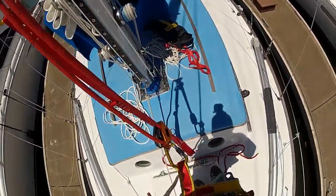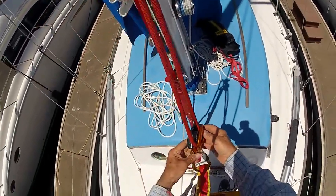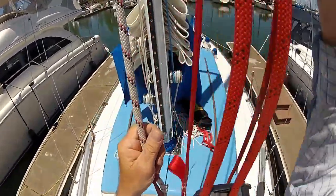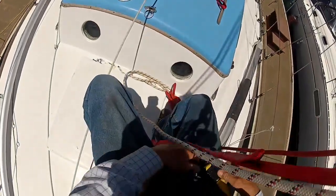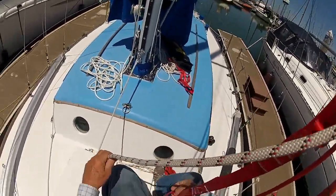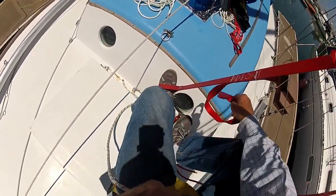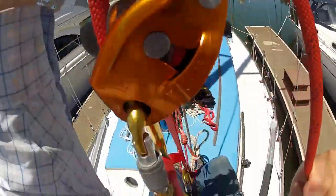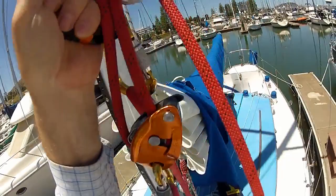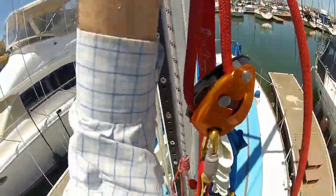I purposely don't tell you how long to make the foot straps because this is your setup, not mine. You're going to have to experiment, get it right, be comfortable with it, and try it in your garage or somewhere before you go up a mast. So it's pretty easy to go up — you have not quite a three-to-one advantage because there's friction, but it's still close; people call it three-to-one. You can stand up and pull at the same time — you've got three-to-one on your right hand, one-to-one on your left hand, and your feet. The safety line you can just follow up. I go about every three or four pulls and then move the safety line up.